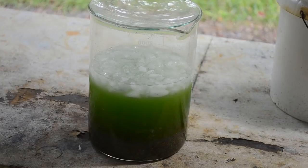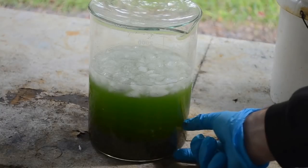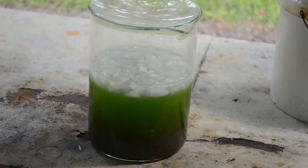From the deep green color, apparently there was still some copper left in there too. It's really hard to get all of the metals dissolved out of so much material. So I think I will set up the sluice to do the second batch, just so that I can reduce the amount of material. I'll be able to concentrate the gold into a smaller amount of material, and the acid extraction should go a little easier, I'm thinking. Ooh, I may wait for a warmer day though. It is chilly today. No water sports today.